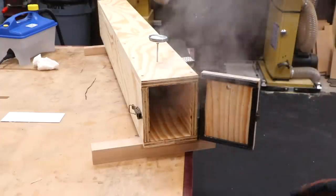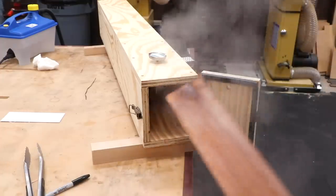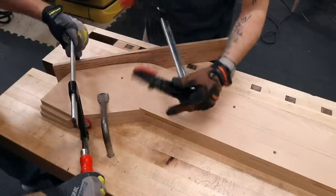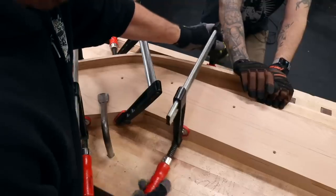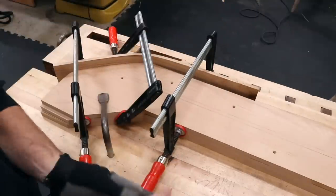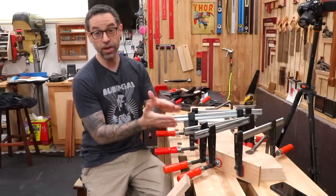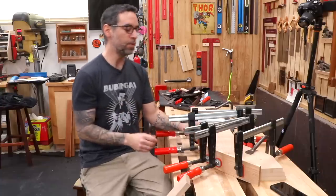It's a good idea to not shove your hand in there — don't ask me how I know. We start clamping from the middle of the workpiece. One of us clamps while the other pushes, retightening as needed. The bend wasn't too bad at all. I think I'll get even better results when I have a narrower piece that doesn't extend higher than the form itself.